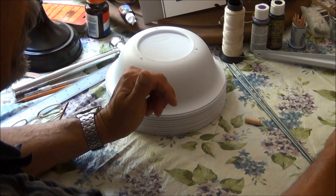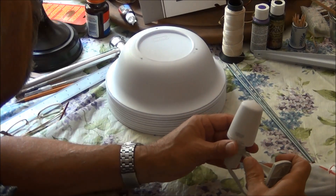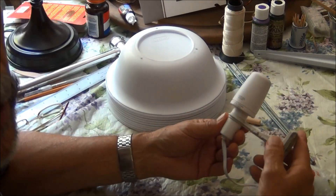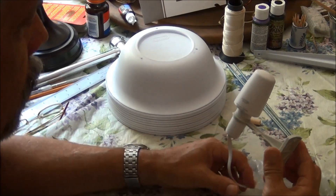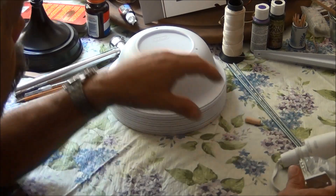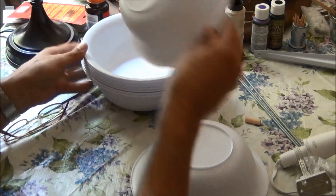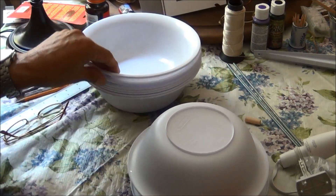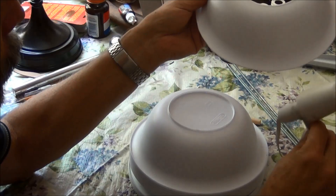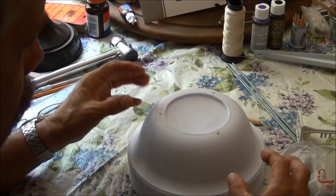This project is going to be a little bit different. I have a weather station and I want to move the temperature sensor so no sun hits it. This is a new temperature humidity sensor for the weather station - the other one is worn out. I want to protect it using something called a solar radiation shield. I got these plastic soup bowls and I'm going to stack them and separate them so air can flow in. I've cut one with a hole so the sensor fits inside, fully enclosed so the sun can't hit it.